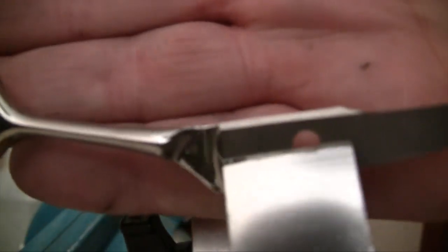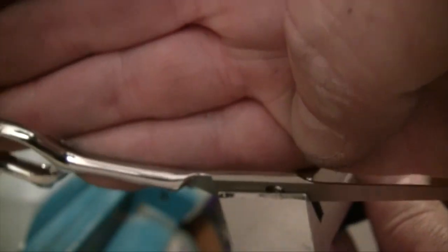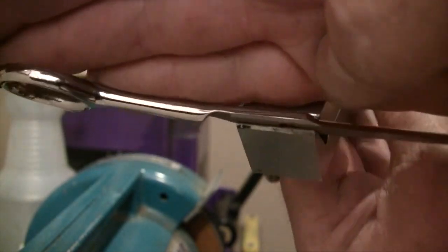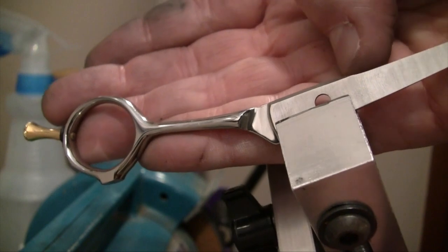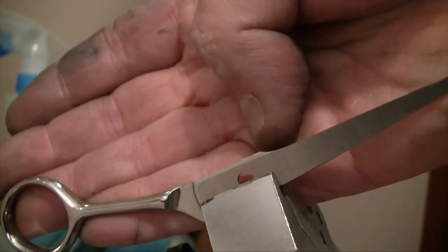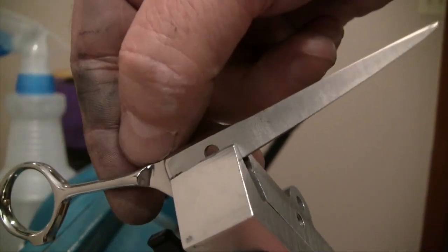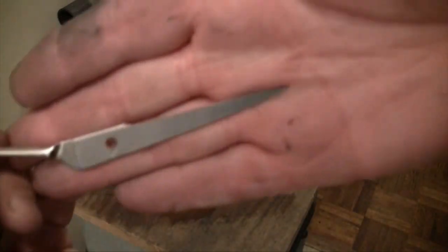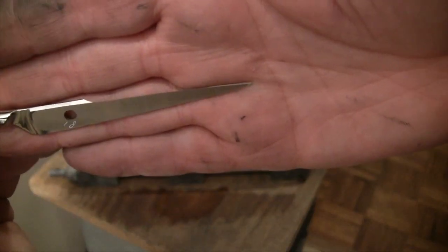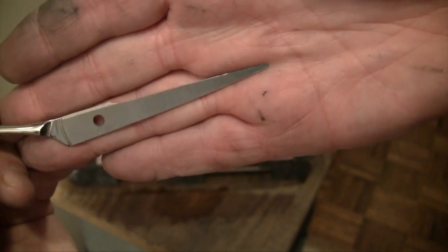If you go over a little bit, don't worry about that. Get an old pair of shears, mess them up, practice, do it again until you build up some confidence — it's really not that difficult, it just takes a little bit of practice. Pulling this up, you can actually see I've chamfered that edge and brought it all the way up to right where the early entry of that cut is just wanting to begin. I might have gone just a smidge too much — I probably would have liked to have had that back just a little bit. But fortunately they don't cut in the very early entry of that cut, so now you can see this is all in line. I'll take this out and go back to the water stone to recreate that ride line all the way from the ride area all the way up to the tip.